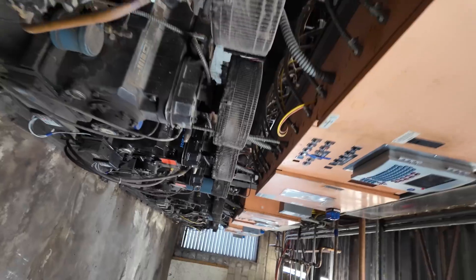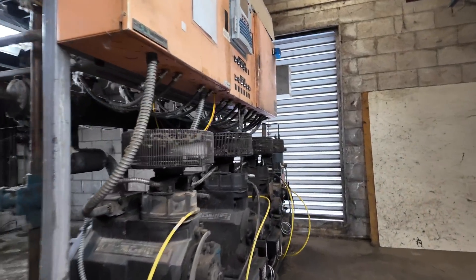That's going to wrap that one up. Basically what we had was a tripped breaker — we didn't know why it tripped. We checked it back to the contactor; it had some pitting going on. Also, the auxiliary switch on the contactor was not working — that's why the head cooling fan wasn't working. We checked the electrical windings to ground, winding to winding. We checked the inrush and compared that to locked rotor amps — all those things showed it was electrically working the way it should. We had nothing to ground, 0.7 ohms between each leg — everything was equal, everything looked normal. And it ran the whole time we were here. Now it may trip out again, but there's nothing we can do at this point other than give it a good hour or two and see what's going on. We're not going to condemn a very expensive compressor unless we know for certain that it's bad. The contactor is cheap assurance — it never hurts to have a new contactor on there, and that one is brand new along with the auxiliary switch. If you guys enjoyed the video and want to see more like it, please hit the like button below, consider subscribing. Until next time everybody — we'll catch you on the next one.